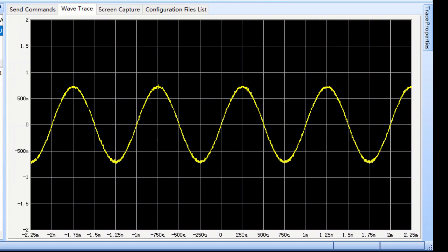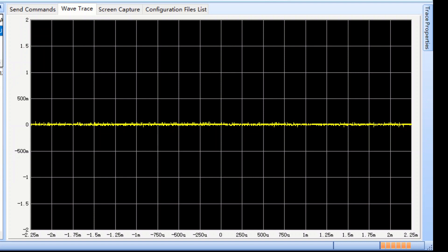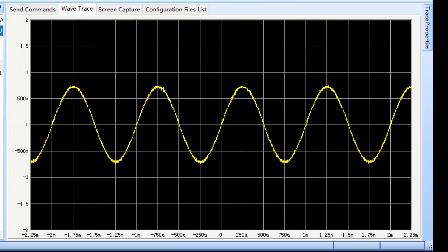It's looking fairly stable. I might have to leave it on for 10 minutes and just let things warm up a little. That's not happening — so I'd almost guarantee that there was some kind of D to A configuration that was messed up as a result of the poor data line, or maybe something it should have received from the DSP that it wasn't, that it now can, and that is now allowing it to be more stable.